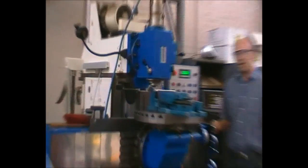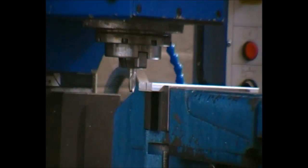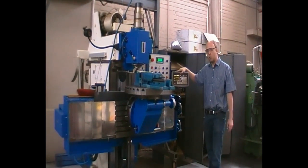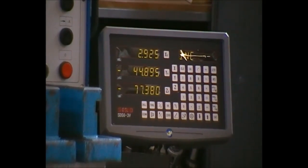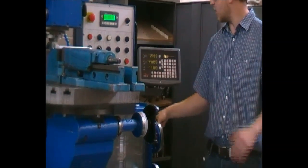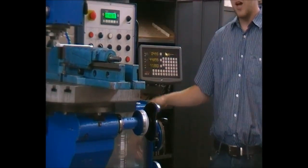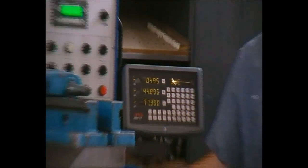The spindle can now be stopped. Move past the part where we can look at the X-axis on the digital readout. We can now take a cut. Since we are just doing a cleaning operation, we can take half a millimeter cut — in this instance it will be negative 0.5. These dials are accurate to roughly 50 microns if used and clamped correctly.